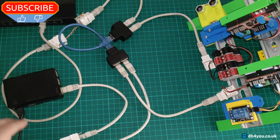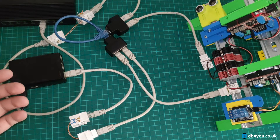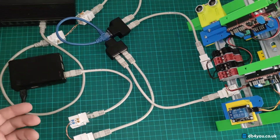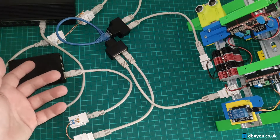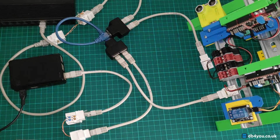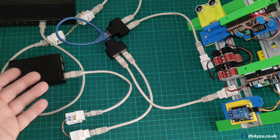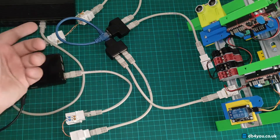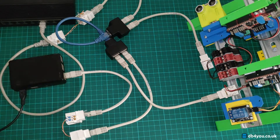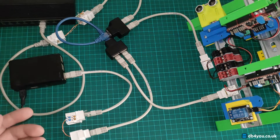So yeah, it is possible to run your home automation Modbus network over RS485 and an ethernet network using the same wire, so you don't have to run another cable. However, it comes with a caveat: this ethernet connection only runs at 100 megabits a second because you're just using four wires — two pairs — and not all of them, which explains why it works. But it will be more than enough if you just have one ethernet cable already run in the walls to connect IoT devices.